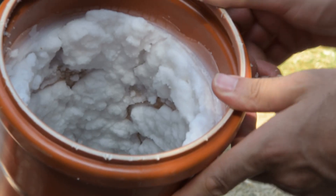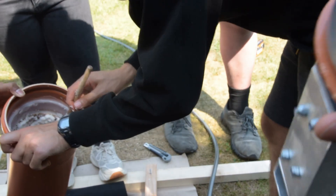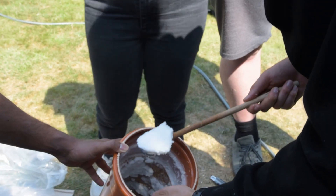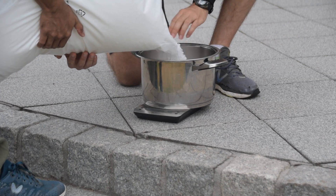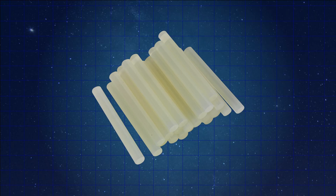Finally, if you remember the paraffin wax grain we made before, it was actually super brittle — it didn't have a lot of plasticity, and if it was chipped or hit, it would basically just crumble apart. So to solve this problem, we had to address the chemical formula. Before, we were using paraffin wax and a little bit of powder dye cement, but that actually ended up making it really brittle. So we decided to stop adding the powder dye cement, and instead add some plasticity by adding hot glue gun sticks to the paraffin wax.